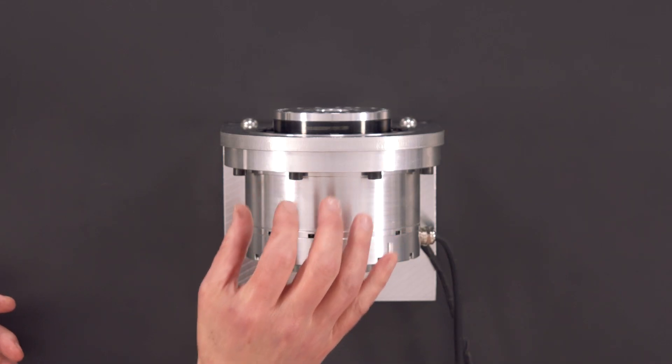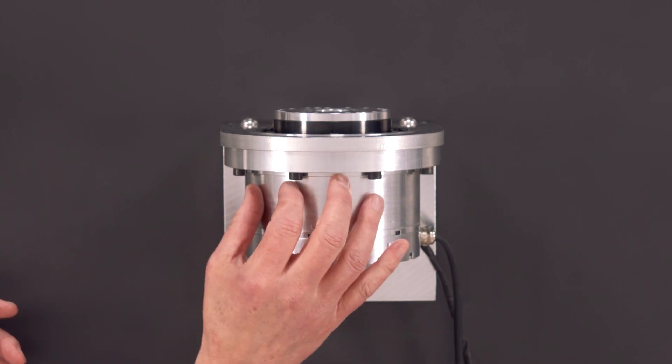What sort of speed do they run at? Speeds — they're not very fast. They're 127 rpm as the max, and they're rated at 70 rpm, so they're really only designed for fairly low speeds, but it's the torque that's the main thing. Quite smooth motion too, I guess. Very smooth motion. Coupled with the strain wave gearbox and the gear ratio, which goes from 51 to 161 to 1, you get very, very smooth output.